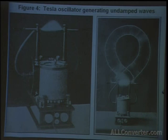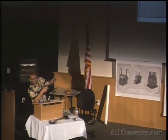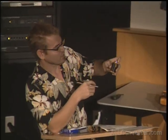Normally, when you break the current from a self-induction coil, and I have one here, you can see it's just a small electromagnet. Generally, you get a voltage to charge the condenser of around 1,000 to 1,500 volts. Now, you get a much higher voltage at the higher supply circuit lines. So if you run it from 220, you can get a little bit higher spike, or maybe around 2,000 volts.